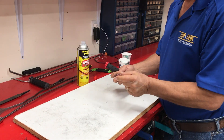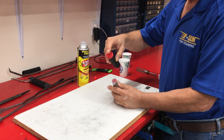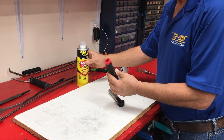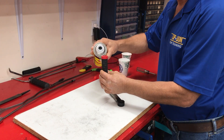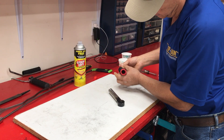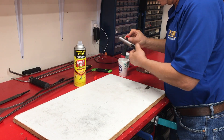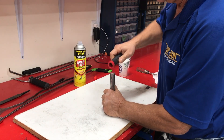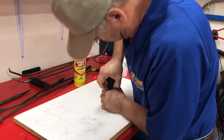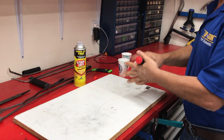We put some hot glue on the end of that handle, which is an important thing to do because we're going to force that rubber bicycle grip onto that steel shaft. It works a lot better if we put our finger over that hole to force it down — that creates an air pocket and it goes on a lot easier because it's a pretty tight fit. We're going to put some Goof Off in there to help lubricate it and help it stick to the bicycle handle. Circulate it around so the inside of the handle gets nice and wet, then put the excess on the handle. Put it on the edge and force it on in one movement, with the heel of your hand on that hole in the rubber to create a nice seal and air pocket. Very easy.